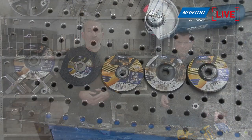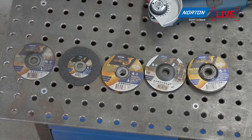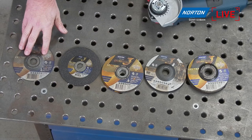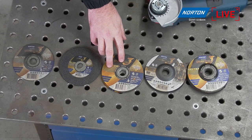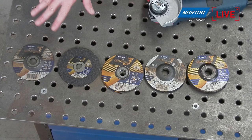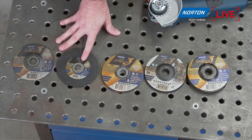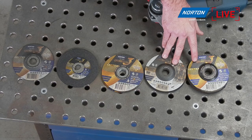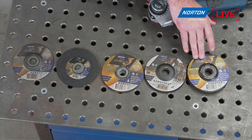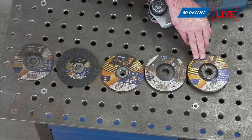So you can see quite a comprehensive range. We have the 0.8 cutting, we have the 1mm cutting — a very popular product in the market — and a 1.3mm cutting disc. After we've been through the cutting family and shown demonstrations, we're going to move to our two grinding discs: the 3mm LCG designed particularly for battery machines, and then the 7mm heavy-duty monster material removal disc. Today we are using some angle grinders, but these are high-performance machines — a 1.7-kilowatt machine.